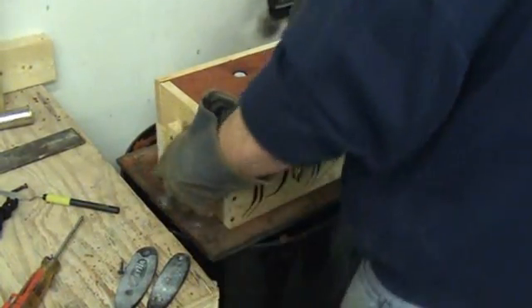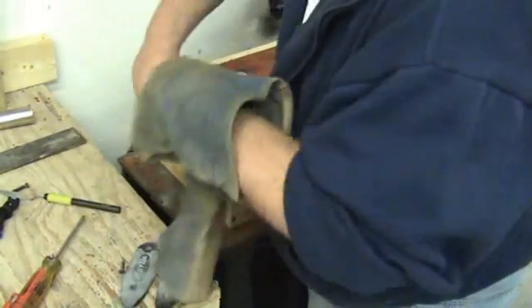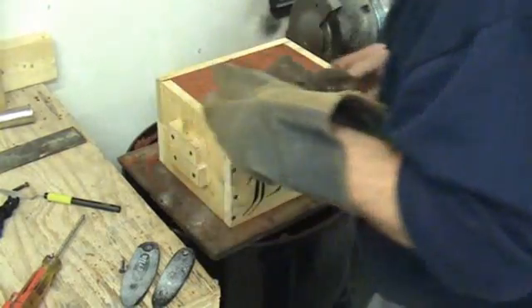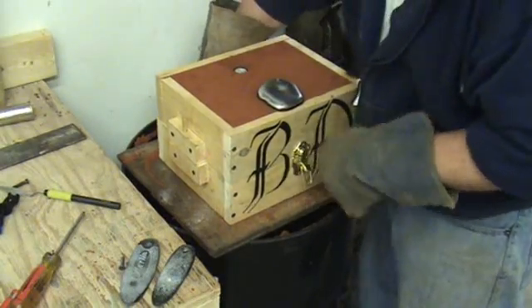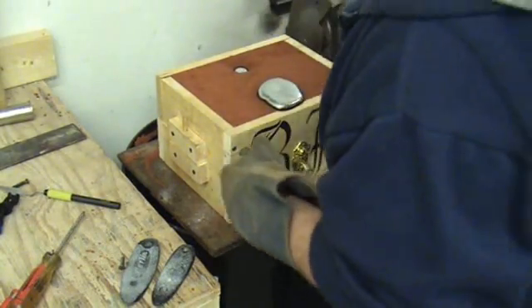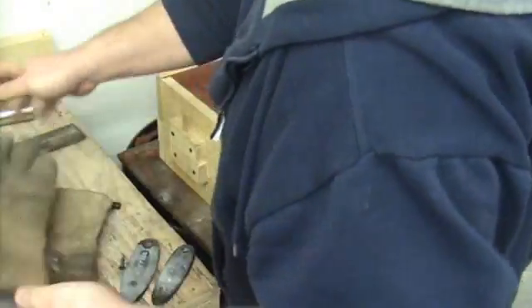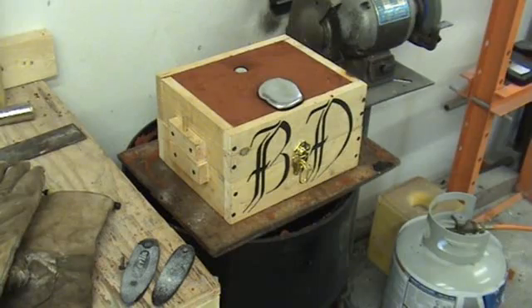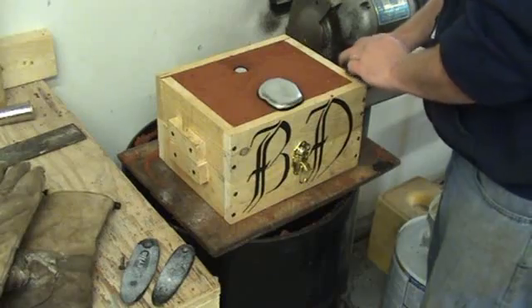I don't expect that they're going to be very good. The aluminum wasn't 100% melted when I poured it. I'm just trying to do the best I can here, basically. I was able just to get the dross off of it, and from there I even chucked a little piece of aluminum that was still hot and still unmelted in there.